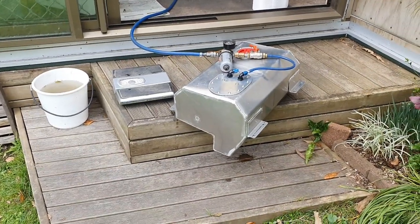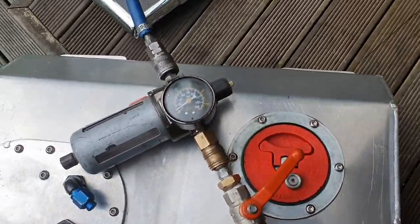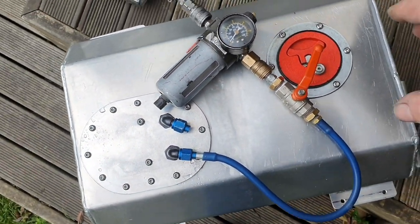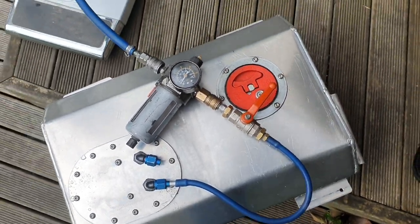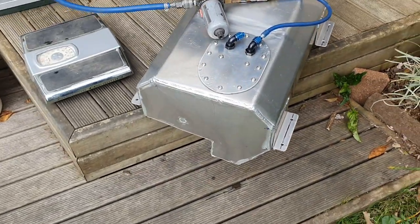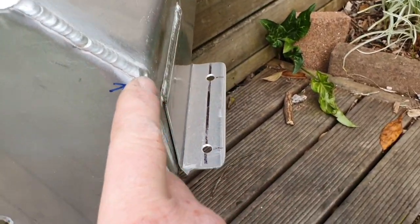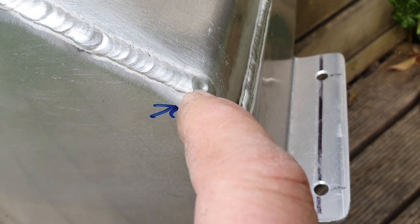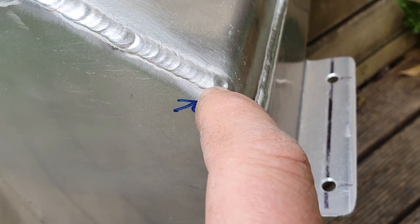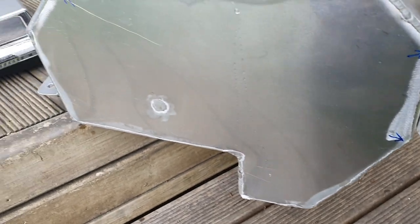It has not exploded — there are some leaks to deal with. That's more than seven psi we're at. Right, I've identified with my blue marker where there are some problems to fix. They're all really obvious if I had looked a bit harder before testing. When you stop a weld run, you need to have the welder on downslope — otherwise it leaves a little pit and you'll always have a pinhole there. There are about four of them.